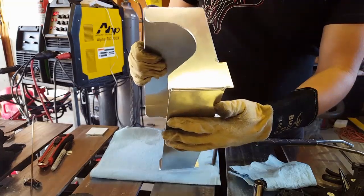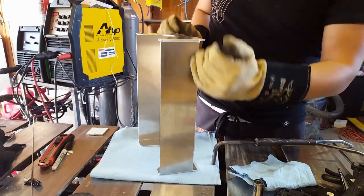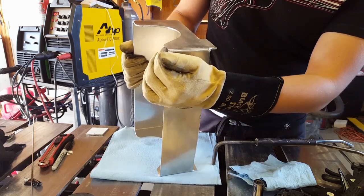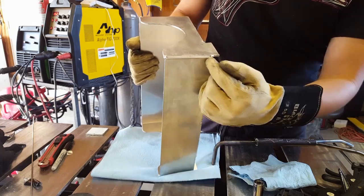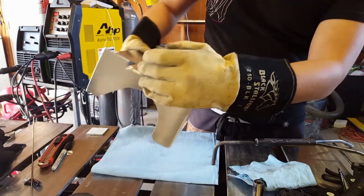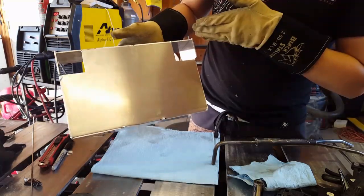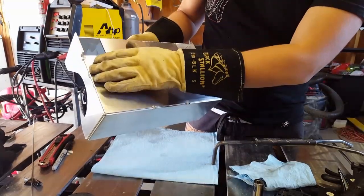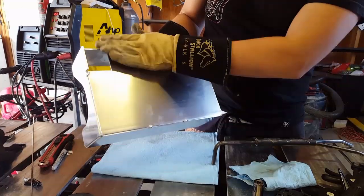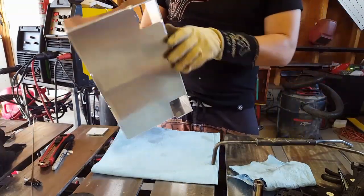What I personally like to do is have all my welds on the corners that aren't the main ones running all the same direction, and I like to have them running from the edge in. So I'll have them all go this way all the way around. After I get those welded, I like to either come and do these in the same direction, or take from one of the back corners and run it all the way around, so that your stop is basically on a hidden side. It's whatever you like, but that's the way I like to do it.